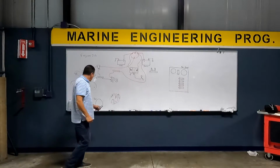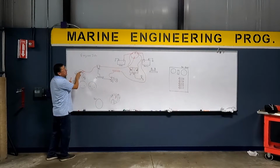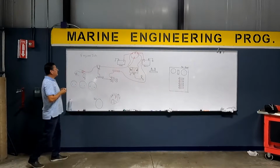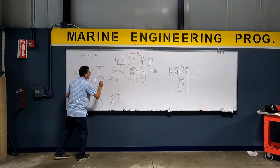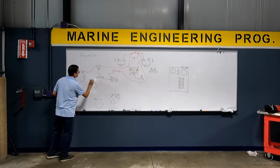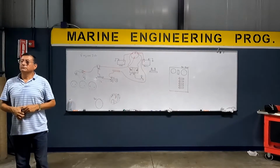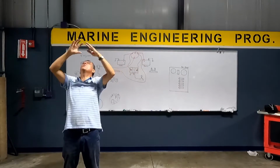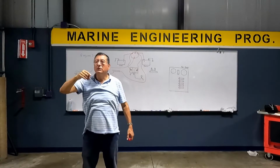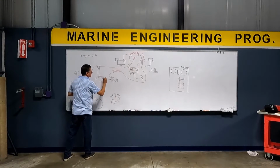Yes or not? What is the color of that signal cable here? Yellow, red. Coming from the switch in the position signal, and it is yellow with red. My friend, this is universal. You are in the console of your boat with 1 million cables. This is yellow red. That's the signal for the start motor. Oh, this is purple. That's ignition. Finito. This one is what color? Purple.